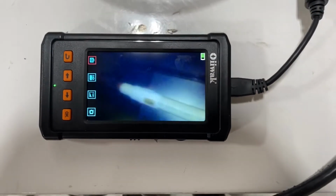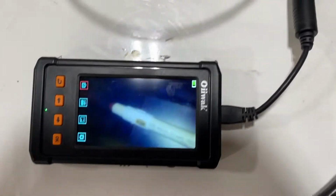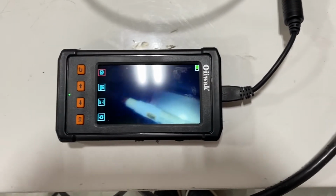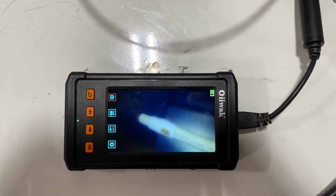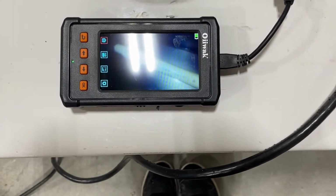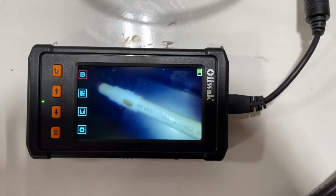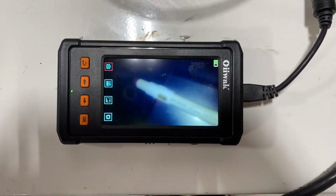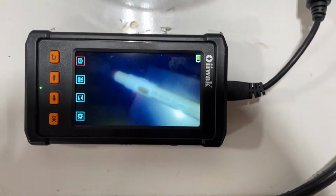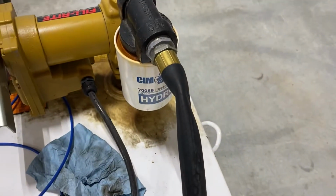And I don't know how much either of those two items are gonna cost, but John, kick the tank a little bit with your foot. I wanna see the gas and the diesel in there jiggle. Okay, good. It is vibrant. So you saw that it was kind of splashing up around that siphon tube. So it should be sucking up, it's not. So we're going to have to do a little bit of investigating. We're gonna have to go and find another filter and possibly another hose, or at least disconnect this one and try to put something in its place inside of there. See if it's plugging up in the hose. Show them the hose there, John, the kink in that hose. Yeah, so we'll do that.